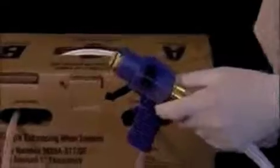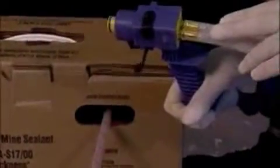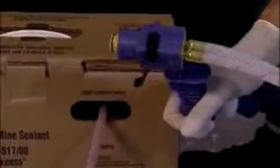The next step is to always make sure your safety is locked. Carefully remove the mixing nozzle, and then noticing that there are 2 openings that the chemicals will come out of, the next step you'll do is unlock the gun, pull back the trigger, and continue to spray into a safe area, as we're about to do, until 2 roughly equal streams of liquid come out.